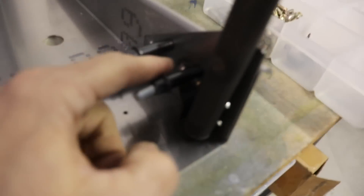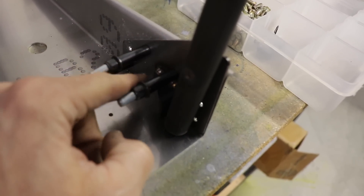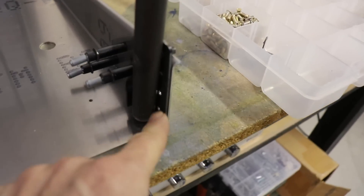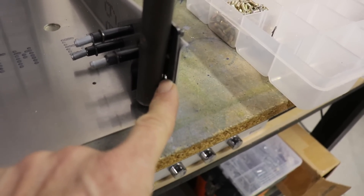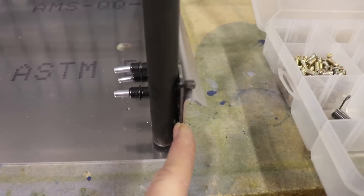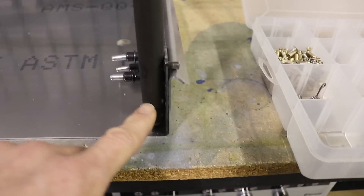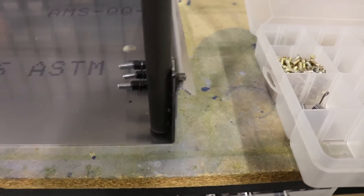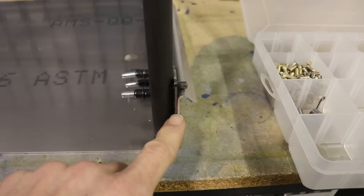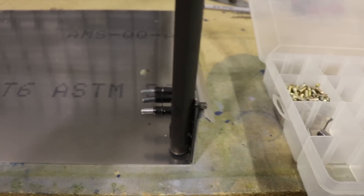In the plans, this steel piece rivets to the seat bottom with all-steel A5 rivets. There are three rivets that go back here. If you use steel rivets there — anything but flush rivets — you'll notice that when you rotate your seat, the seat back will rub on those three rivets every time you move it. And if you have this primed, painted, or powder coated, you're going to start cutting into that coating and maybe even damaging the steel the more you rotate your seats.